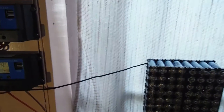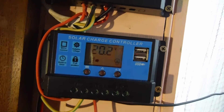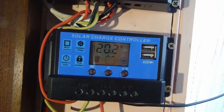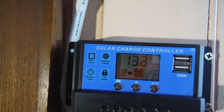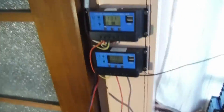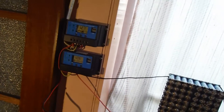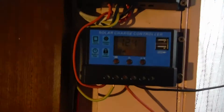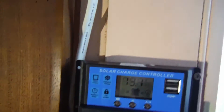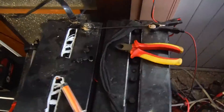So if we go and disconnect the feed wire, the open circuit voltage of the panel jumps to the 20s, like so. And now watch it dip and pulse, because it's charging the lead acid bank. This then means that my lithium bank down here, if it's been used, will get charged first. So once the other charge controller starts kicking in, the top one kicks back out. So that means once this one's charged — it's nearly 600 watt-hours of goodness — then these two will start charging.